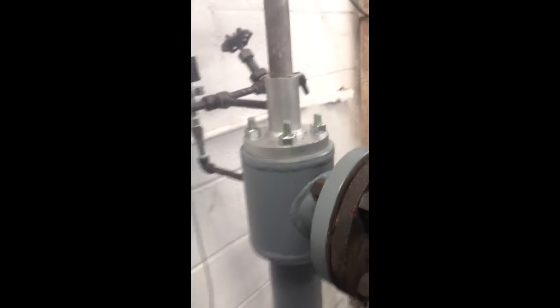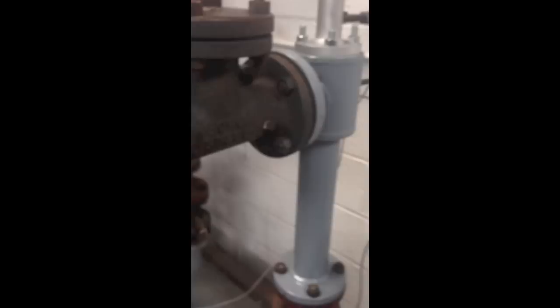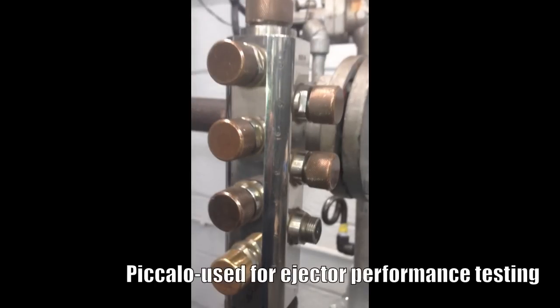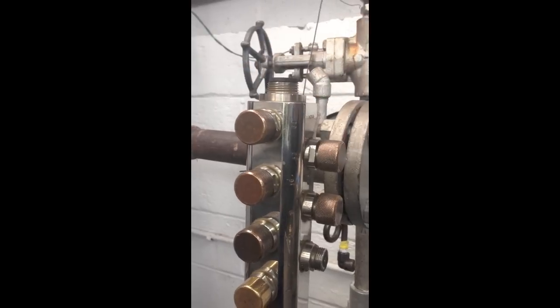Here we show the valve that controls the steam to the ejector. Opening the valve increases the motive steam pressure, which passes more steam through the ejector, and vice versa when you close the valve. In order to do a performance test on a steam ejector we use a tool called a piccolo. It is attached to the suction of the steam ejector and consists of a series of various size orifices to pass different amounts of air as the suction load to the ejector. It is used to generate a performance curve of different loads in pounds per hour versus vacuum pressure.